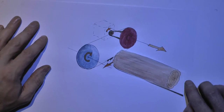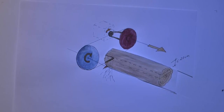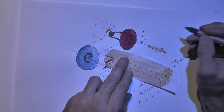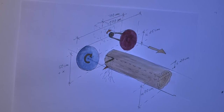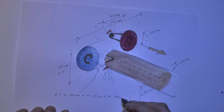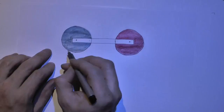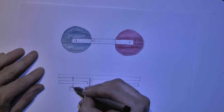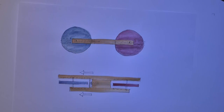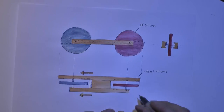It is impossible to bring my historic bandsaw in a good position for milling, so I made plans for a new band mill. I decided to have a maximum cutting width of 70 cm and a maximum cutting depth of 20 cm. So unlike upright table bandsaws with their C-shaped frame, the frame here can go straight from one wheel to the other. This frame also supports the wheels on both sides, and that is a good thing because it can hold a lot more blade tension.